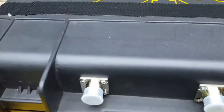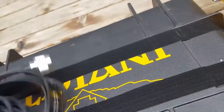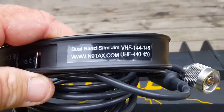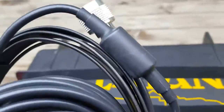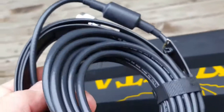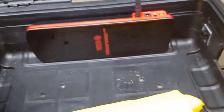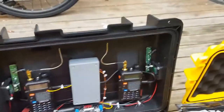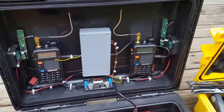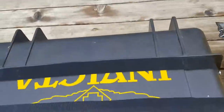Because I have two antenna outputs, I do have a diplexer but had some problems with it. What I'm running is the N9TAX.com dual band Slim Jim. These antennas are awesome - set up for dual band with an RF choke, good connectors, all N-connectors, with 16 feet of coax. I got two of those with extension coax, 100 feet of paracord, and basically throw it up in a tree. One antenna goes up about 30 feet, the other about 15 feet below it. You've got to keep them in the same vertical plane.